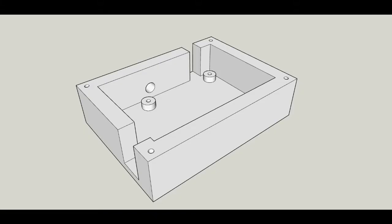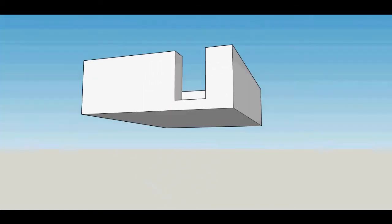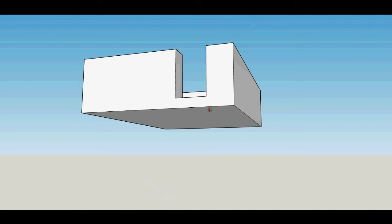Now, more shells will also cause more pull, and if you have a lot connected to that object, such as a long flat base, you will also see more warpage. A lot like having a greater infill will have more pull. So I would suggest you experiment with different shell counts to see what works best for your particular object.